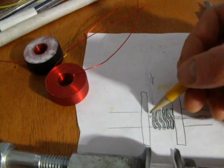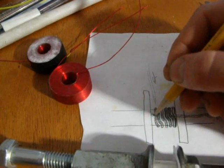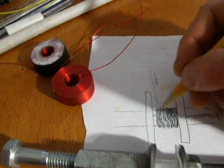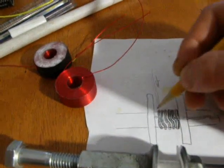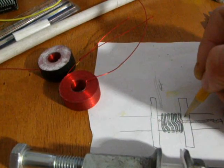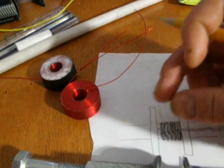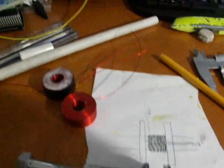For the second layer, the first turn goes into that gap — a little bit deeper — so it touches the first washer. But the last turn of the second layer does not touch the second washer; it goes in between the turns of the previous layer. Each turn of the second layer fits in between turns of the previous layer, and the last turn doesn't reach the second washer. The layers alternate this way — each layer's turns fit in between the turns of the previous layer. This is how the coil is wound in the most dense way.